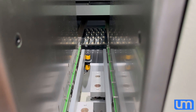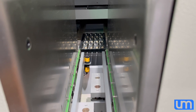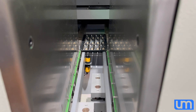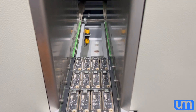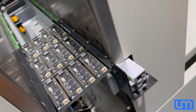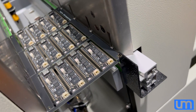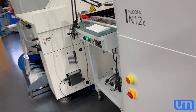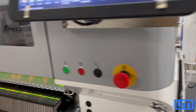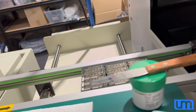So I used to do 15 boards per panel on these, but I've reduced it down to 12, because I've now matched the width for my tiny panels, so I don't have to adjust the conveyor length at all. Pro S3s with the new RF layout on it. And I need to check this one and send this one through.